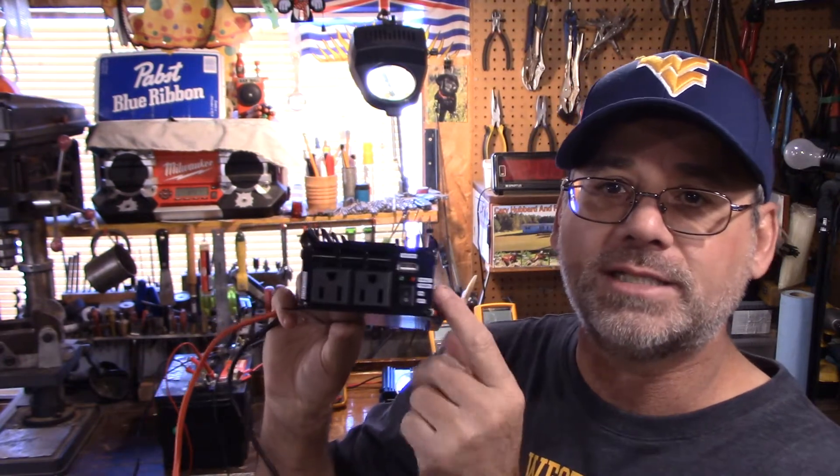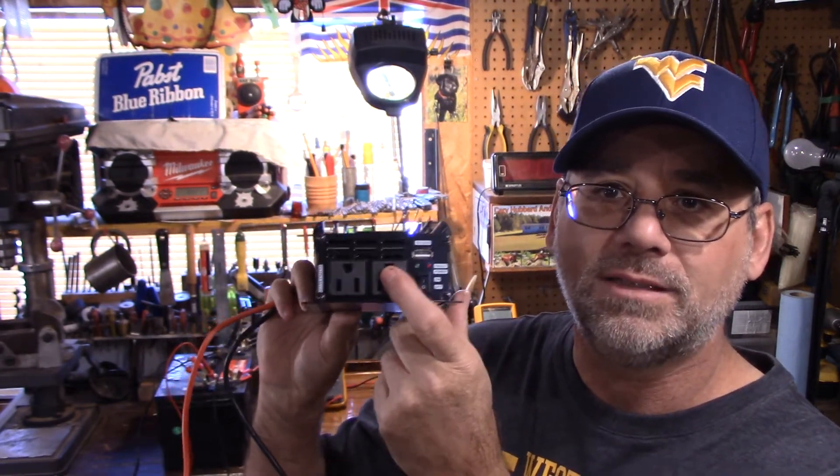This is a 600 watt. Now a lot of people think you can get 600 watts out of one of these outlets — and you can't, not the ones I've looked at so far. Maybe the higher end ones, I'm not too sure. But usually they're split between both of them. Most inverters will actually surge twice as much, so out of one outlet you might get 600 watts momentarily. But generally 300 is the max, and you're lucky to get that a lot of times.